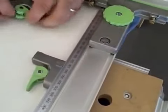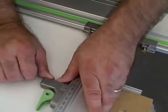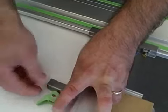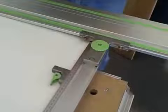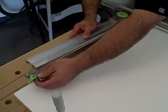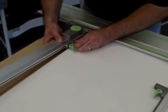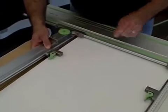Now, I want to show you something. See this little hex right in there? If someone says this is sliding too much on here, you could take this, loosen it up here, and take a 2mm hex, put it right here, and tighten it ever so slightly so you have no movement on your rail. Lock it in. Same thing with this one. Slide in here just like this. Take it down to 330. Right here, if I can see with my eyes — and just lock it in.